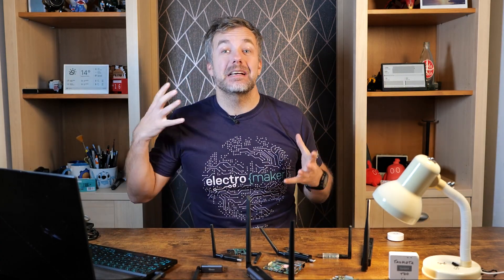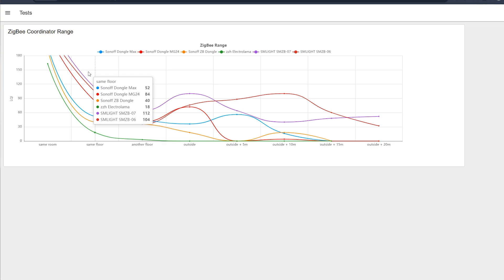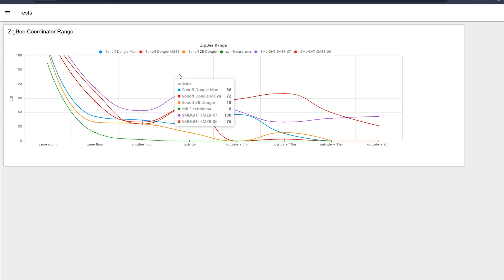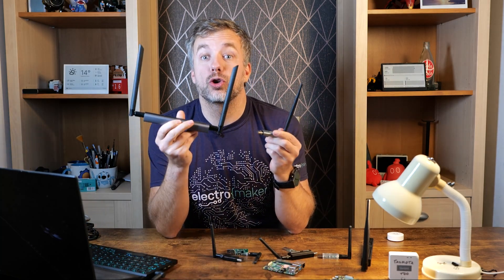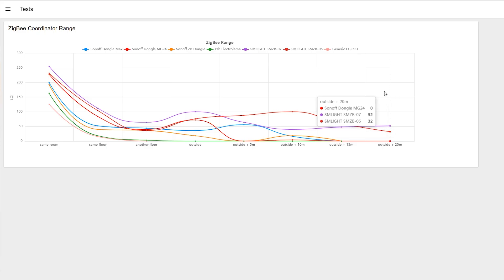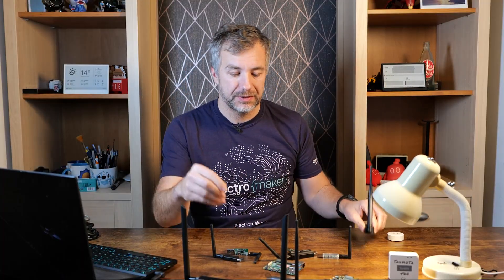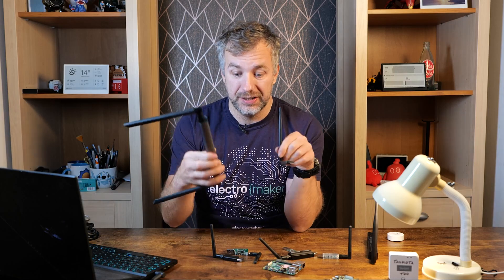And I think I finally came to a conclusion why the MG24 is so much more expensive than the Sonoff Dongle P — the range on this thing was honestly one of the best performing from the entire lineup. The Sonoff Dongle Max performed slightly less at distance, and I think that's due to interference from the Wi-Fi antenna already present on the device while I had it set to AP mode. Previously I was recommending SMLight coordinators, and they are still brilliant devices, but considering you can get these as well at a nice price point, you should definitely check them out. You could buy one of these and turn your old coordinator into a router to improve your Zigbee or Thread network.